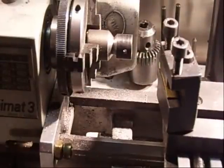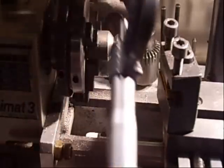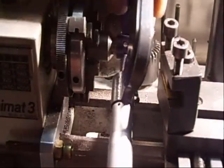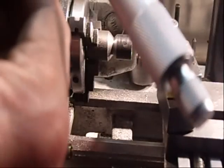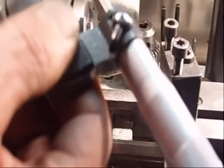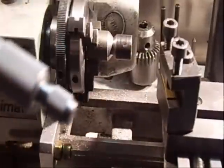I put it back in the main chuck — the spindle. And from now on it's micrometer time, because now it must work very accurately and very slowly. I will check how much it is, and it's actually 40mm and one hundredth of a millimeter. So about two tenths — I must go down. One tenth I turn down, and the last tenth is grinding. And then very slowly, check and double check, and check with the cylinder till I get a smooth finish.